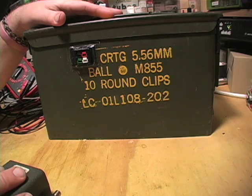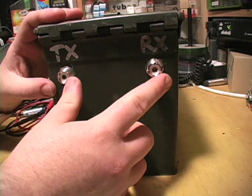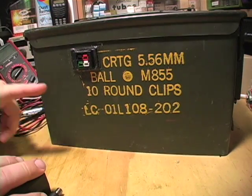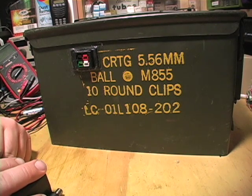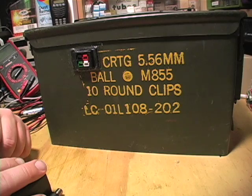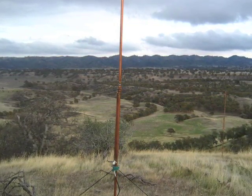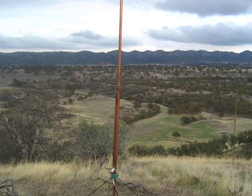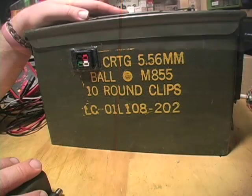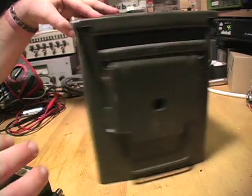Right here we have what looks like a 50 cal ammo can because that's what it used to be. If you notice, there are antenna connectors on the back and some Anderson PowerPole connectors on the front for charging. When I built this repeater it was actually for a hunting trip in the fall up in Northern California. We had about an 1800 acre ranch that we wanted to have communications across — if someone's down in a hole back behind a ridge somewhere, they're not going to be cut off. With these radios set at two watts, this repeater worked wonderfully.